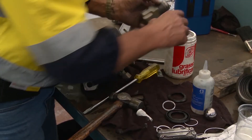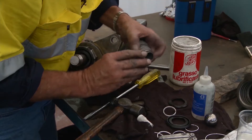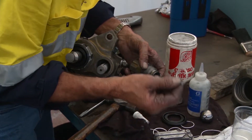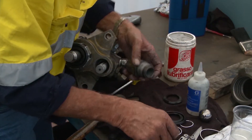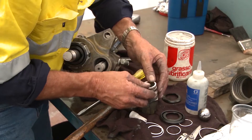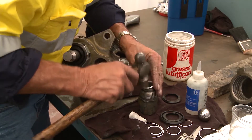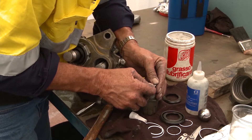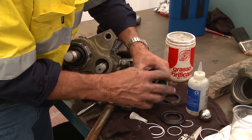For reassembly, make sure those ring lands are nice and clean before putting the new o-ring on. Nice clean ring land, a little bit of Vaseline, slide the new o-ring around into the ring land. If you took them off and they're second-hand, get rid of them and put the new ones on. Don't hammer it back on — just use applied pressure and it'll click into the ring land.